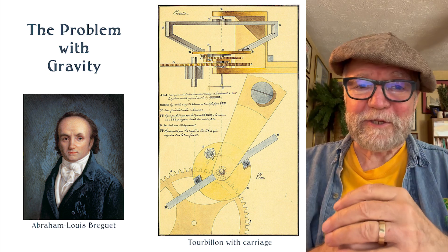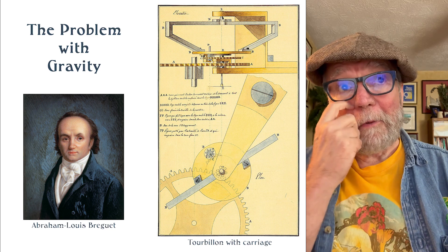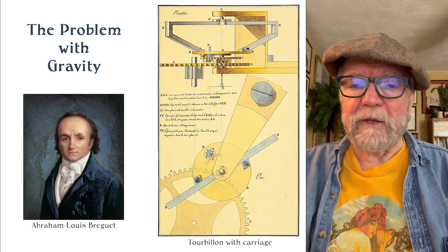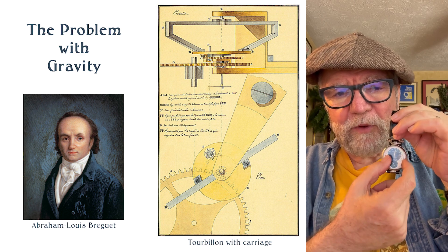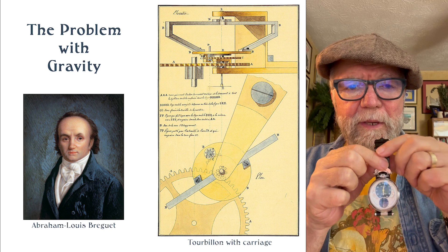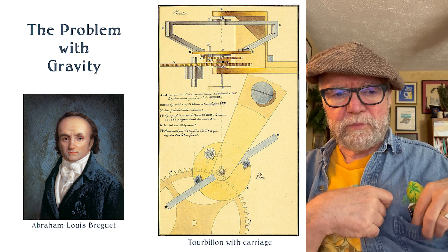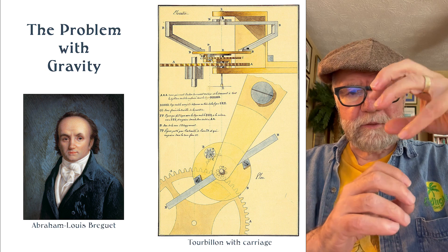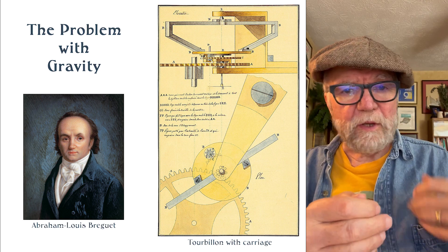This is not a course in physics — very simple. The problem is a problem with gravity, and a number of early watchmakers knew they had to deal with it. This is the closest I have to a pocket watch. In a pocket watch, gravity pulls down on the hairspring, making it uneven. That pocket watch was held in a vertical position, so what Abraham Breguet did is that he made the tourbillon — it put the hairspring in a cage that would go in different directions, offsetting having it in one fixed vertical position.